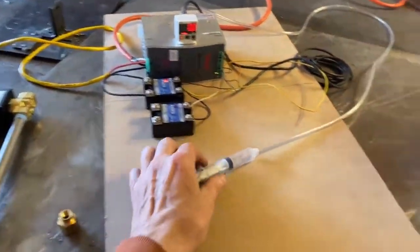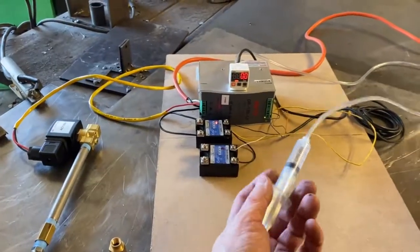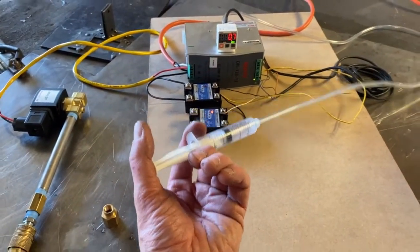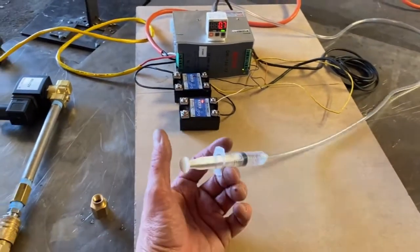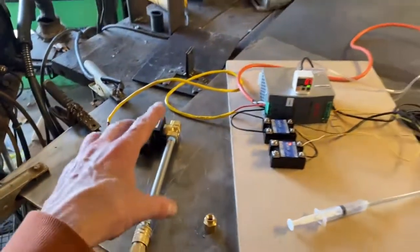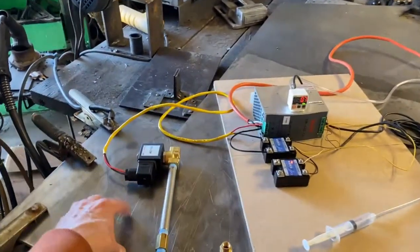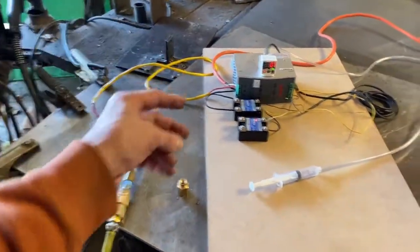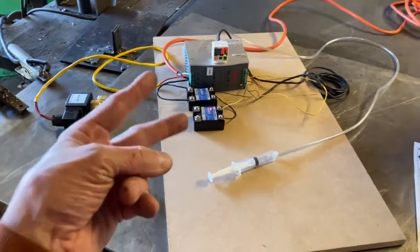Okay, now, when the pressure exceeds 1, it shuts off. This one turns on. I want to have them like that on purpose. So let's say we want to set a regulator that does 2 PSIs of pressure. I need to take some propane at 100 PSIs and regulate it down to 2 PSIs to imitate a natural gas burner that I'm working on.